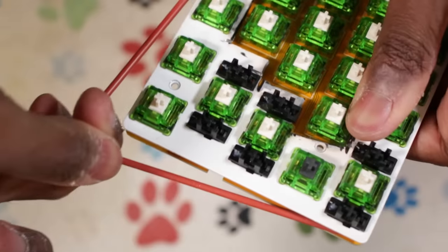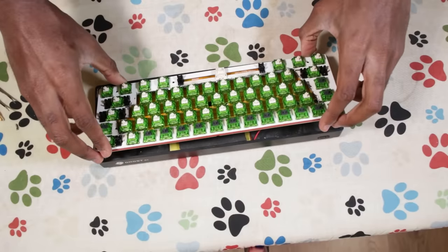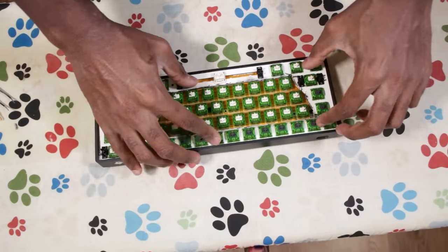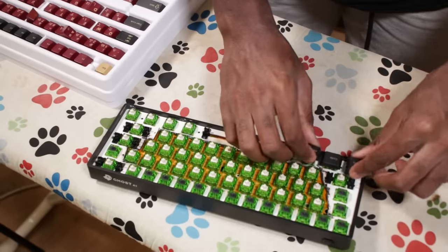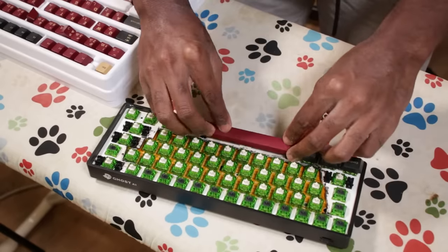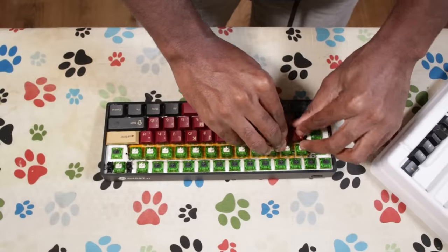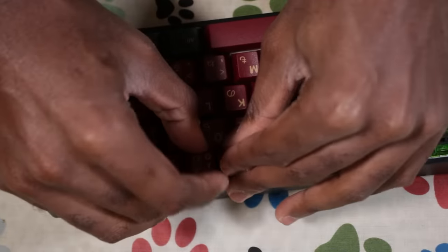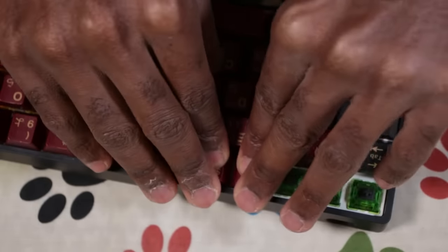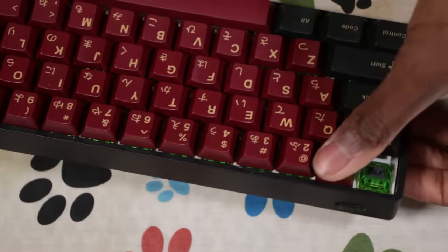The O-ring sits in between the PCB and the plate. That cutout right there allows the O-ring — not the PCB — to rest on the ledges on the perimeter of the case. With the plate and PCB secured into the case, all that was left were the keycaps. A massive thank you for all the support on the latest videos. I did not expect that PewDiePie video to blow up like that, and the fact that so many of you subscribed really means a lot to me. But there is one more thing I had to do.